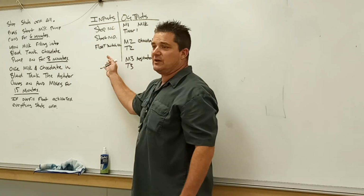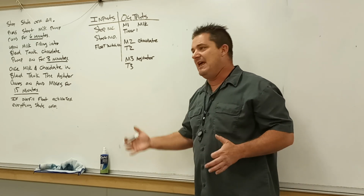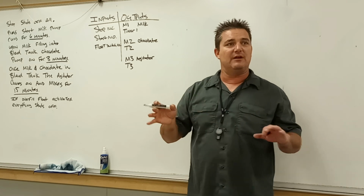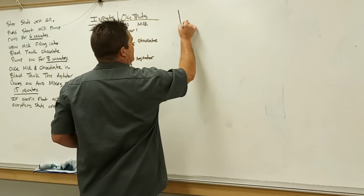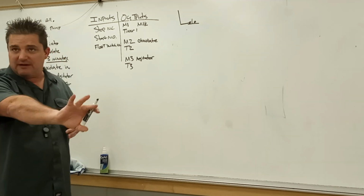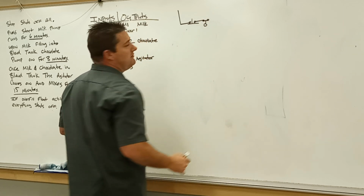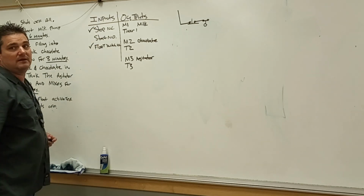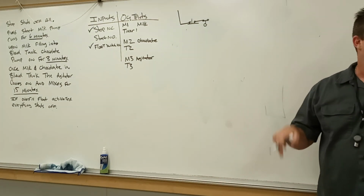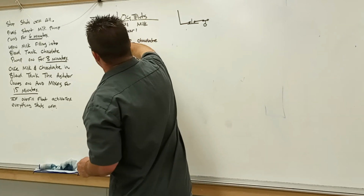Now, predominantly, what's the use for utilizing the float switch? Can anything operate if that blend tank is too full, or is everything basically shut back down? So that way we don't overflow, right? So what I like to do, I knock out my stop button first. So that way stop shuts everything down, follows my instructions, but also my float switch, right? So if stop or the float switch is activated, when somebody comes and presses start to make a new batch of chocolate milk, it's not going to work. So I knocked off those 2 inputs.